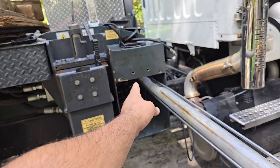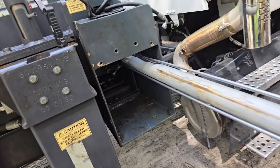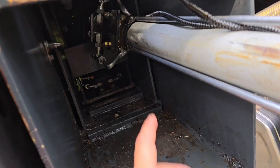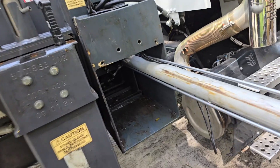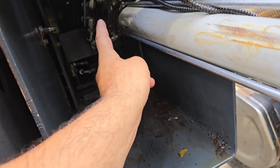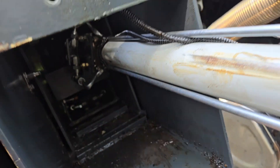However, there is an alternative way. You can actually try to pull the outrigger piston out — that hydraulic ram out, like you saw at the beginning of the video — and bring it out through the opposite side of where the pads come down. What it is, is these fittings in here, because things are moving all the time, they get loose. And there's a loose fitting right there.